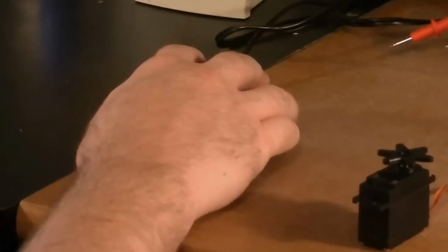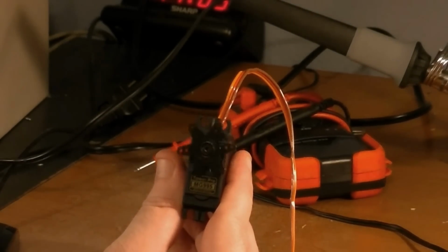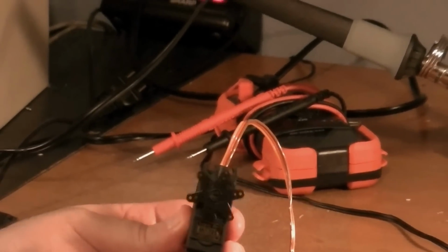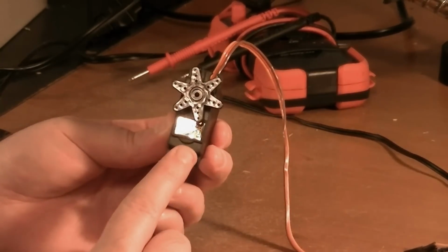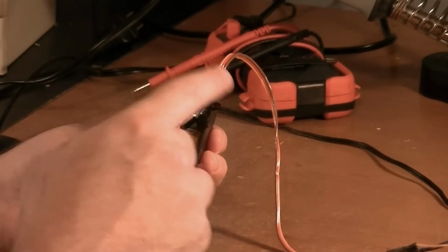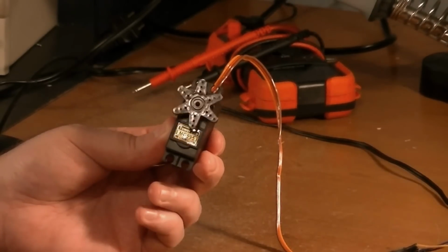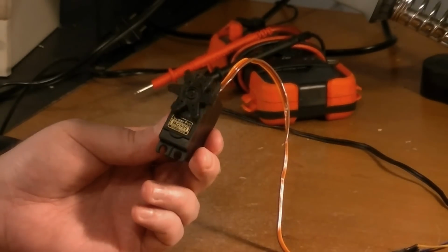Okay? So now, if you go 180 and then upload that code, now here's where you're going to see full rotation. That's full rotation, looks like it's going counterclockwise for 180. And stay on the servo, and all I'm going to do is change my servo.write to 0. Stay on the servo, and we should start going clockwise. So 0 is full speed clockwise, and 180 is full speed counterclockwise, and we know for this particular servo that the midpoint is 105 for stop.